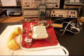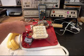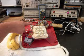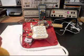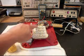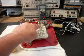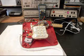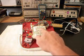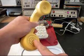So now what we want to do is our final checks. And I'm going to go ahead and hold the hook switch down, and I want to plug the unit in, and we'll ring it. I'll let that go one more time. Give you some dial tone. Now, if you watch the analyzer, we're going to walk through our numbers. I'm going to end in a 2, and I want to do that one more time. Give you some dial tone, since that was one of the issues. I want to end in a 2, and now I want to transmit into the handset just like before.